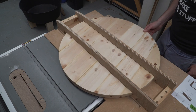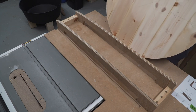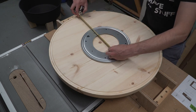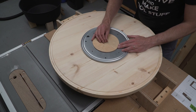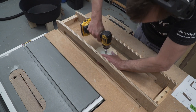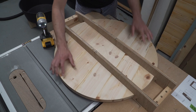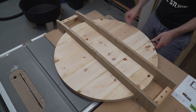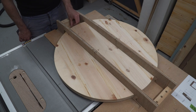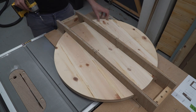Hands up if you can spot a problem. It quickly became abundantly clear that this was not going to work. These bearings are designed to be secured to both sides, but access holes need to be drilled through one part. Given we didn't much feel like drilling four big holes in either the cover nor our workbench, we had to get creative. Thankfully the solution was simple — we cut a circular puck the same size as the hole in the centre of the bearing, then at the same centre point as everything else, screwed it to the workbench. We then dropped the cover on top of it and all was right in the world again. Well, not everything — the cover still had a little uppy-downy play where the router would be cutting, so to stop this we placed a little finger underneath to remove the wobble.